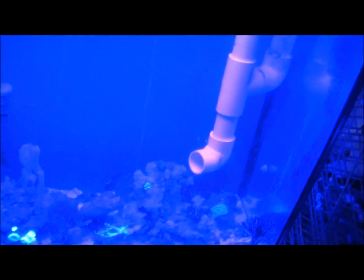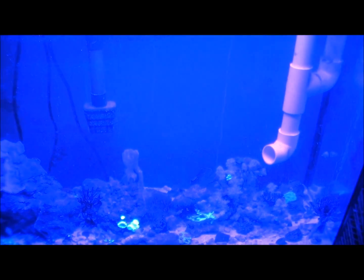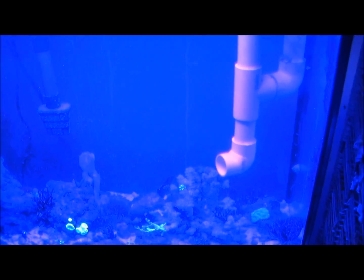Something I did: I converted this to 400-cycle — I've converted all my lights to 400 cycles instead of 60 cycles, using an aircraft power inverter to accomplish that. I did have to modify the board in this one, that's why the seals are broken. Had to modify the board in this one, had to modify the Kessil too. Minor mods, all they are. I actually thought I killed this one, but it turned out I just had a burn connection where I'd resoldered the board's power supply.